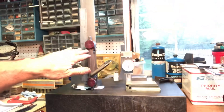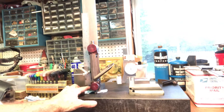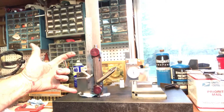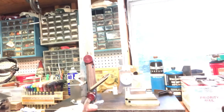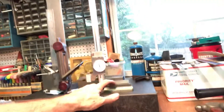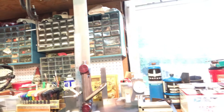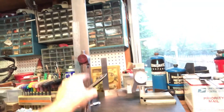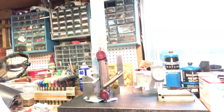When I was milling these to size, I put a shim in the side of the Kurt vise on the Bridgeport mill so the jaws would press evenly and the pillar arm could not move around. I used half the thickness — I'll show you the shim in a minute. When I was marking these out, I used a feeler gauge — half the distance — and this large machinist square alongside, filling the space to get it square. That way your arm is fairly perpendicular. If you have the time to set it up right, why not do it right.